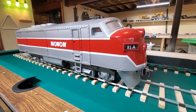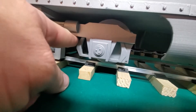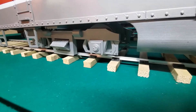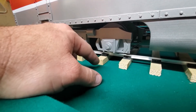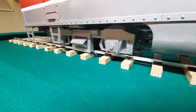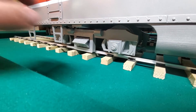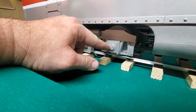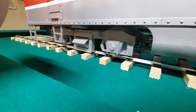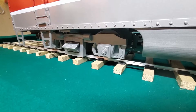I just unpacked the locomotive from our last show and it happened again during transport - my axles snapped. These should be riding up here but the axles broke off. That's the second time this has happened, which tells me I either need to make a stand, or this 3D printed axle just isn't strong enough for when you've got the weight bouncing around. I'm hauling this in a trailer inside a Rubbermaid tote with foam, but when it bounces in the back of an enclosed trailer it just does a number on it.